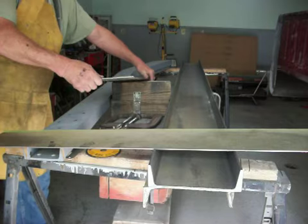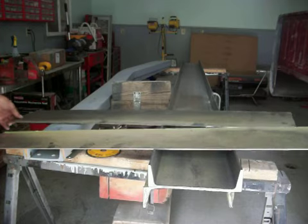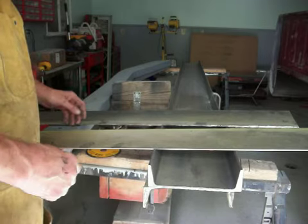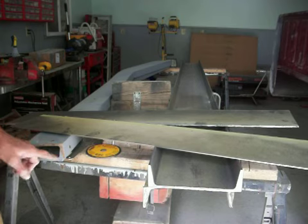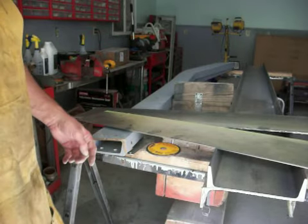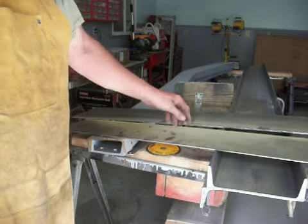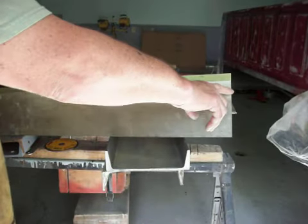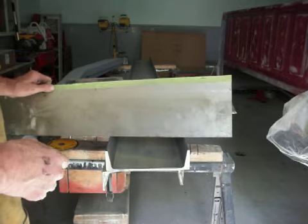Okay, so here's what I'm doing. I bought a bunch of sheets that are 18, I think, by 24 or 18 by 36. And what I did was I sort of cut them up, measured the beam. This beam inside here is basically 4 1/4 to 4 1/2 inches. You can see it has a taper there. I don't know if you can see that. But anyway, what I did was I cut the piece wide enough to accommodate that. And then I marked the piece 1 1/2 inches down, so that that's where I would put my bend.